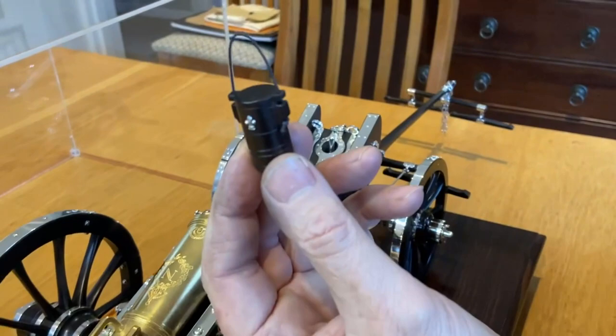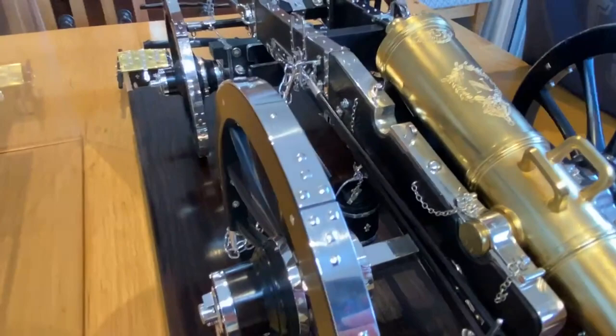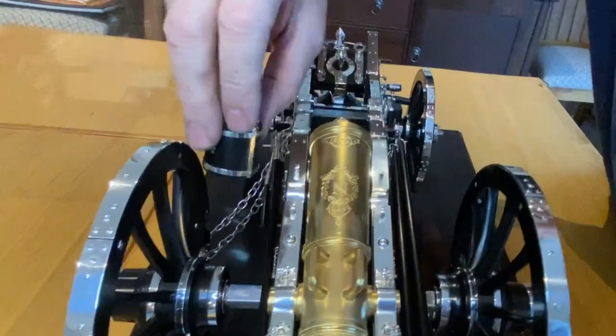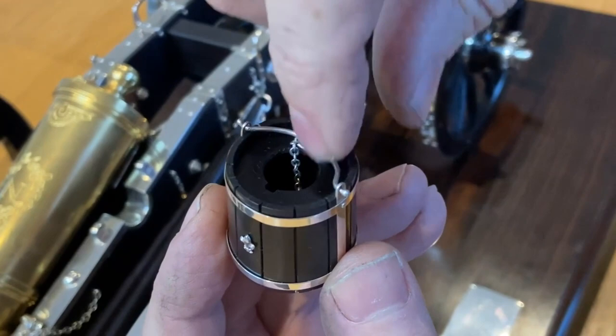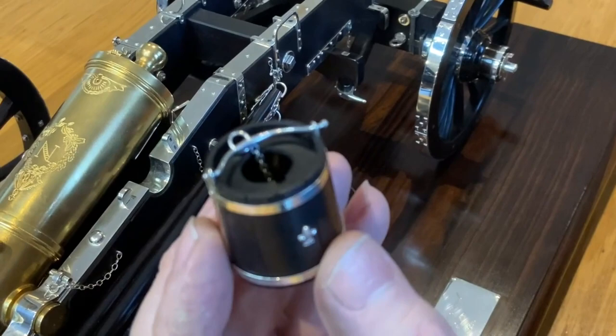And the bucket? The little bucket is hidden on this side. There's the little bucket — also copied from the same gun that's in Lille. The way it works is you turn the lid and it's got little locating lugs, so the lid drops inside. You'd have water in your bucket and the lid could never come off — you couldn't lose it — because if you did lose all your water during battle it would become very unsafe to shoot the cannon.